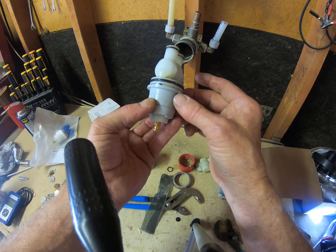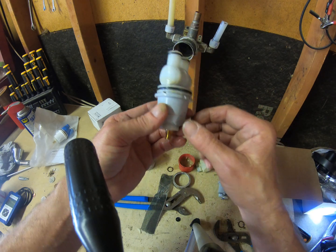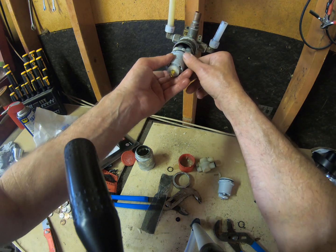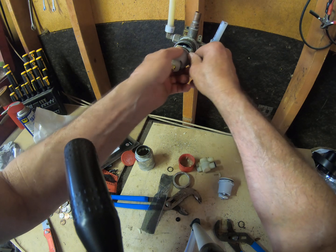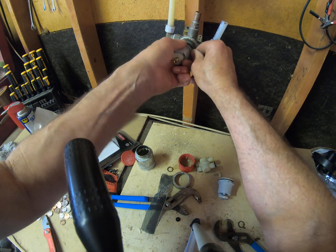These come with a hot and cold side. The hot side is stamped right here. There's a temperature adjustment here. So on this one, we're simply going to go in hot to hot side over here. Give it a little wiggle, and you get it back in there. Just like this. Don't force it because you're going to lose the seal on the cups.